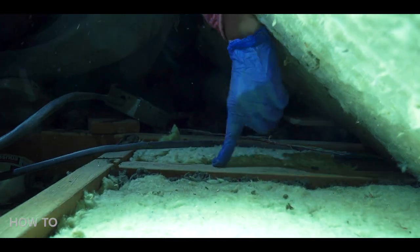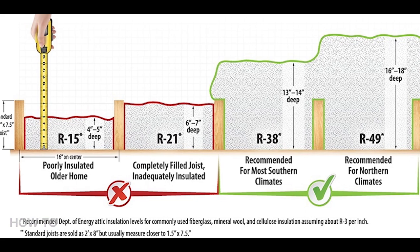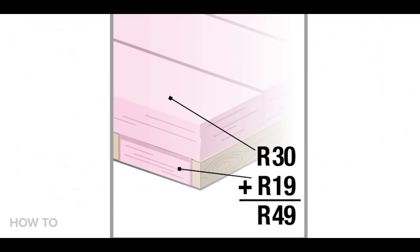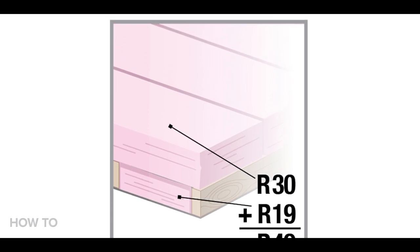The contiguous part means that wherever drywall is, insulation should be touching it. If it's not touching it — for instance, if the insulation is on top of wires instead of underneath them — the insulation will do nothing. Also make sure there's no air gap between the layers of batts, which are the strips of insulation we're using. You want the insulation to be the same depth as the joists if you're using batts and not blown insulation, because otherwise there would be an air gap when you add the second layer.